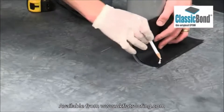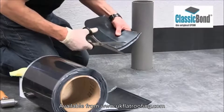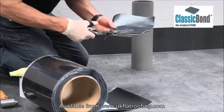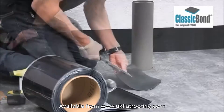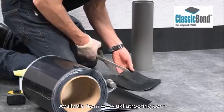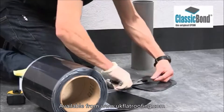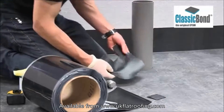To shape the tape, the exposed outer corners are removed as indicated. Cut a square measuring half the width of the pipe to be sealed from the centre of the pressure-sensitive tape. This will allow the flashing detail to be drawn round the pipe, creating an upstand.